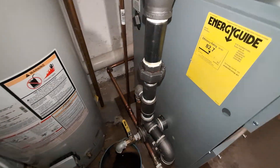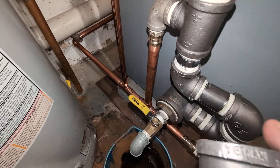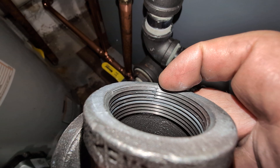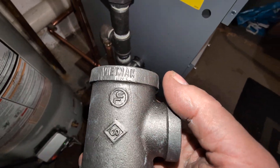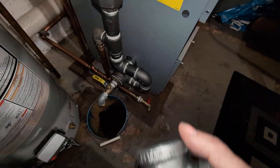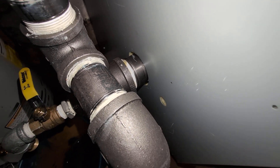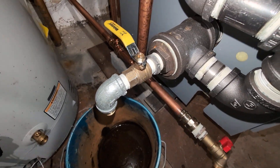Speaking of fittings — I put this fitting in here and when we filled it up, you can see by my thumb there, the crack. You can see it's split. Malleable fittings should not be cracking and splitting. I believe the manufacturer should exercise a little bit more quality control. They have an outlet here of two and a half, the push nipples are two inch, so that's definitely an increase, and we've got a very large bushing there.